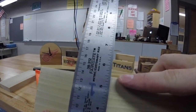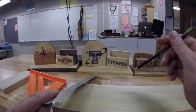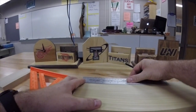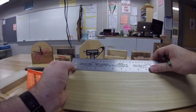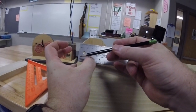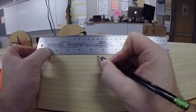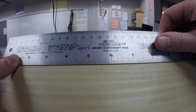You can see right here it is at five and a half inches. So that is really easy — it means we need to go down five and a half inches along our board to measure off the clock face. So what we are going to do is just set the ruler on here. You can do it one of two ways — this way or use the speed square. So you put it right at the edge of the block, keep your ruler straight, go down five whole inches, and you mark the half inch with just a little mark that goes across. You can see there is five and a half inches and there is the mark.